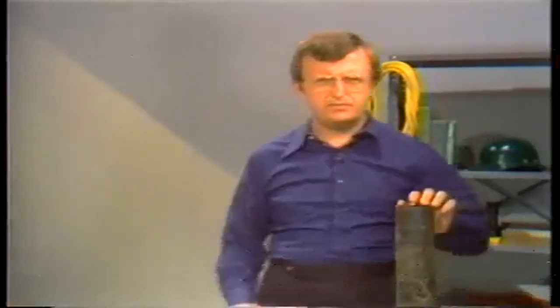Warping is caused when a section of the water wall overheats. This is fairly easy to spot. It may be indicated by a large number of leaks in a small area of the water wall. Now, tube blisters, like these right here, are bulges in the tube surface, which form when the tube metal becomes so hot that it softens and is pushed out by the boiler pressure.